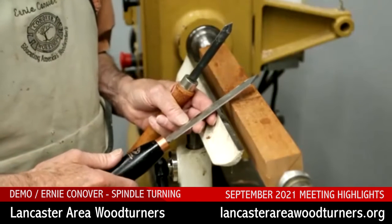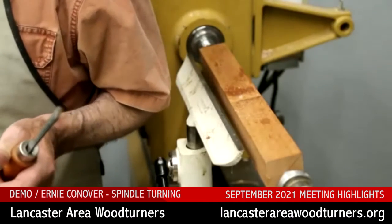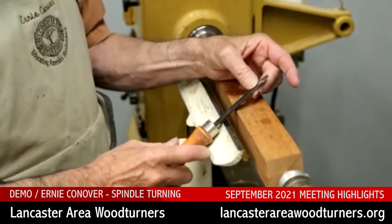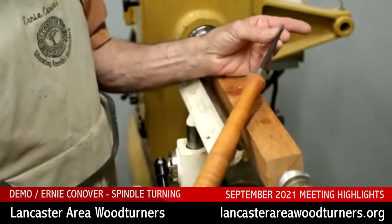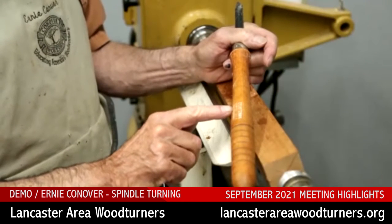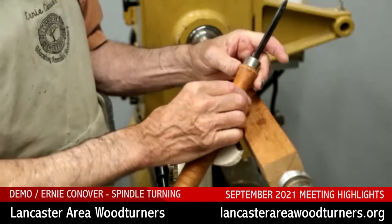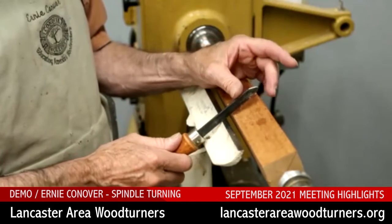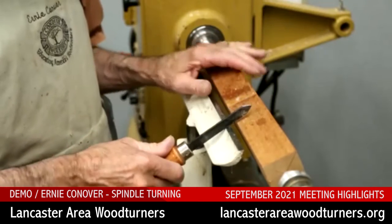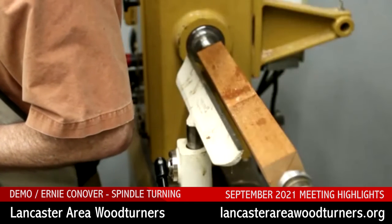Unfortunately, nobody makes one that's thin anymore, and I don't know why. I have to bitch to Ed Gandy the next time I talk to him, but if you look around, you can find these Craftsman high-speed steel tools, and they're actually made of M2. They were sold all through the 70s and 80s, and I see them at yard sales, and I always buy these tools because they're fairly good steel, and they're little parting tools, just a dandy. I use this one all the time.